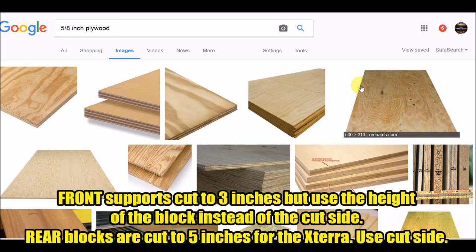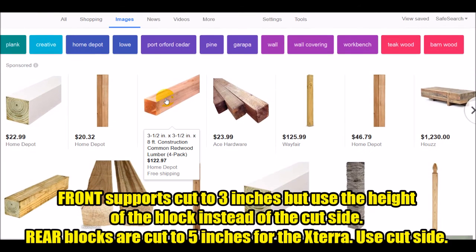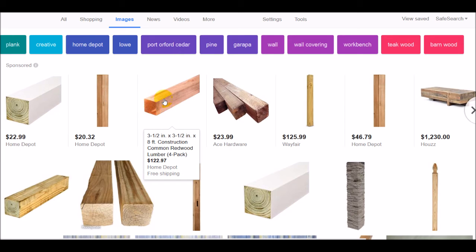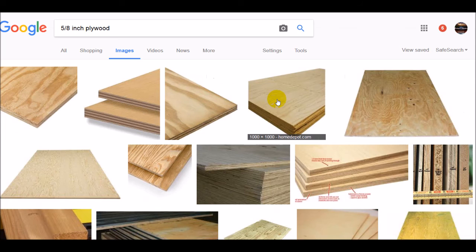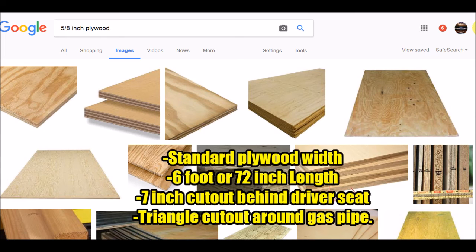I think I cut the front supports at 3 inches, and all I did was use these 4x4 wood blocks — I cut them 3 inches in length — and I just used the height of this as my underside support for the front portion of the plywood. Then I just came in with some 2-inch screws and screwed right down through the top once these were in place underneath the plywood. I just put 2 screws and that was it. With 5/8 inch and 4 supports, one on each corner, I actually placed them about 2 inches from the corner, offset, just so they could kind of be out of the way. You have really good support with this plywood solution.